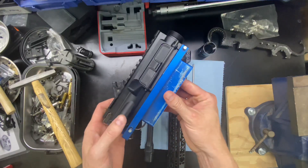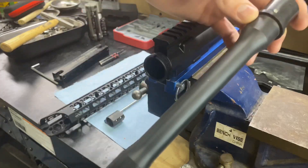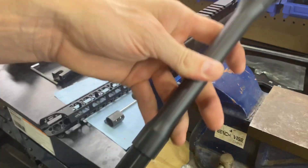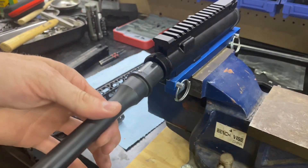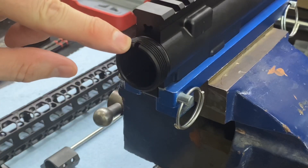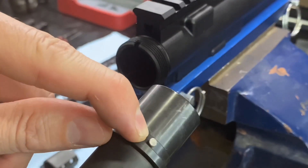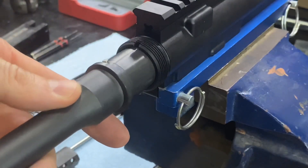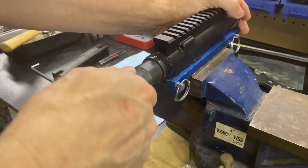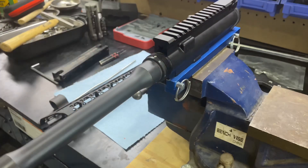Let's go and put this in our vise. What we're going to do first is put the barrel extension into the receiver. You can actually do it this way, where we just do the barrel first. It just goes right in here. We have this little notch cut out on the upper receiver, and then we have this little pin extending out on top here. That is going to perfectly line up the barrel. We don't need to do any timing or shifting on this barrel — it's going to slide right in there and be a perfect fit.